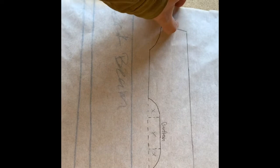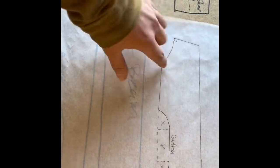All right, when it comes to frame number two, I was saying that I was gonna leave parts out. Like, I'll leave this batten notch out and the chine notch out over here. But since this is frame two, the keel is gonna end up being right here, and then behind it is gonna be the floor timber. And so this is just a drainage hole, so I'm definitely just gonna cut that out as well. But yeah, progress is slowly moving along.